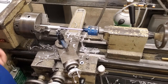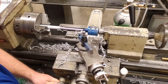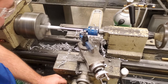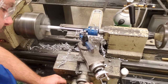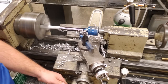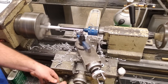So we'll take one more pass. Let's zero this guy off of here. Okay. Loosen up the knob on our micro dial, touch our tool bit off. Re-zero. We'll take another roughly 20 thousandths off. We're taking some heavy passes. And sometimes if we take a heavier pass, it will bump that tool and adjust it. So we'll run this here and we'll see where it puts us.